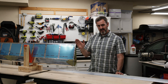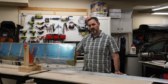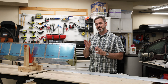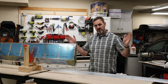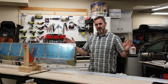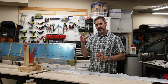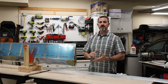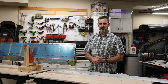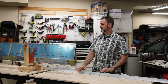What I need to do today to finish this up is first put rivets in all the rivet holes, then get some back rivet tape on it, and then partially set each rivet using the back rivet gun. After each rivet is partially set, I'll go through one last time and set it the rest of the way. I do have the Cleveland trailing edge dies for the pneumatic squeezer and I like how that works reasonably well, but I've been getting really good results with just the back rivet gun, so I'm going to stick to the back riveting gun on this flap.